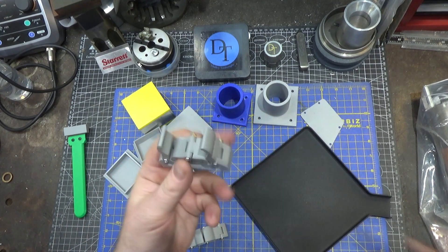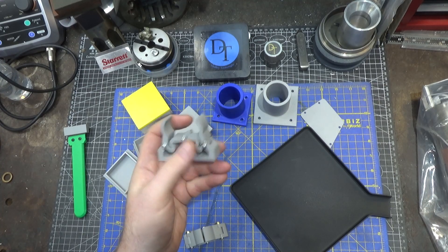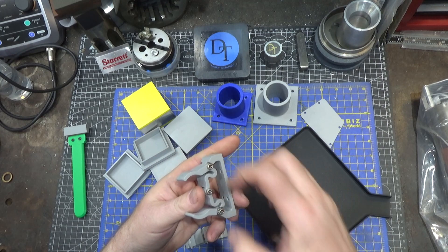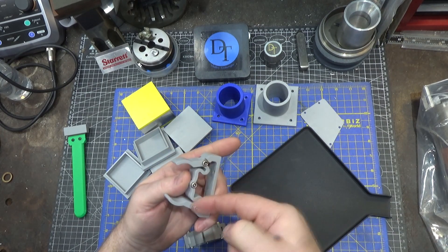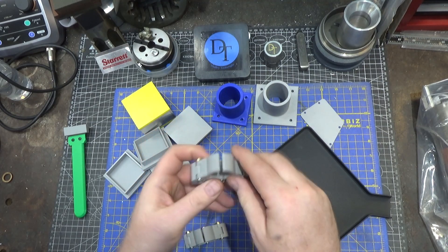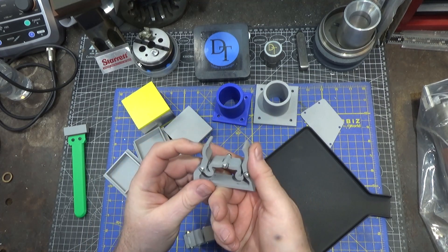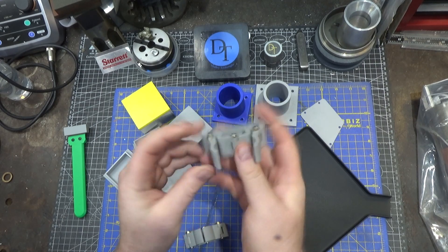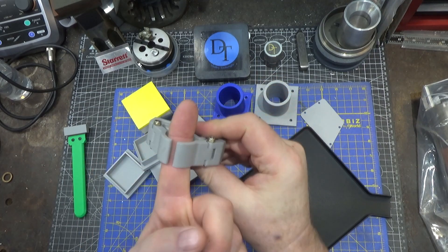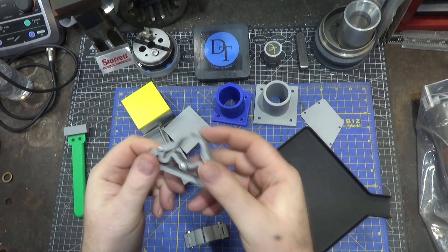These are compliant mechanisms that I find really fascinating. All the screws here are just rotation points and basically what happens is this material is spring-loaded — that's why they have the funny angles, so you've got more distance to preload the material. This is a bi-stable compliant mechanism, meaning it's only stable in one of two positions: either all the way open or all the way closed. This is to hold brooms — you mount it on the wall, pull your broom out by just pulling, and push it back in and it slides down and holds there.